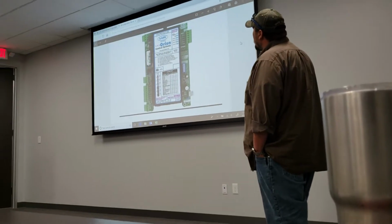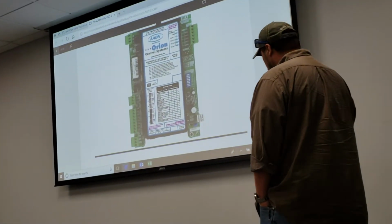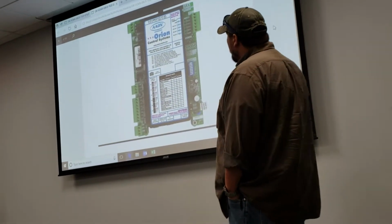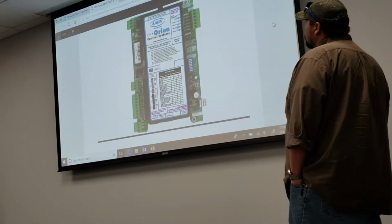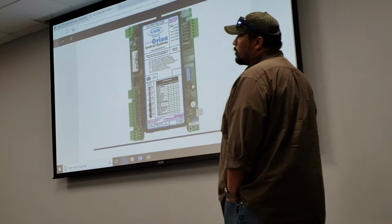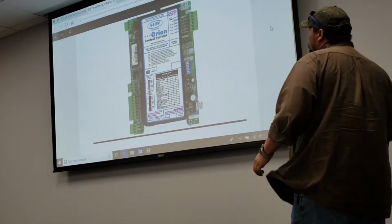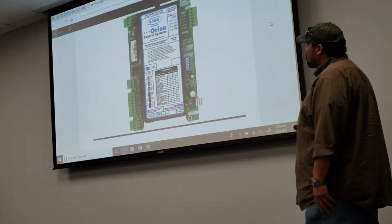We've got an EEPROM right here. They did away with that on the new boards, and I'll show y'all some of the new boards. Whenever you call in to do some troubleshooting, have this number with you, have it handy. That lets us know what you're actually working on. SS1030 is going to be a VCMX that's in a package unit.